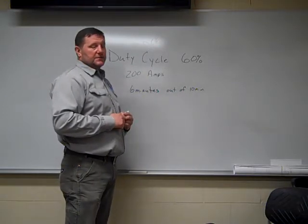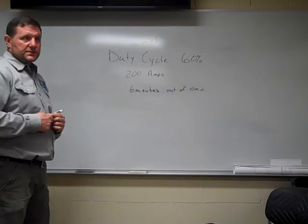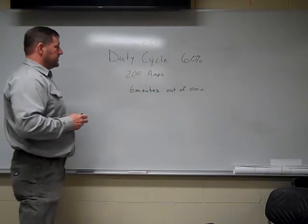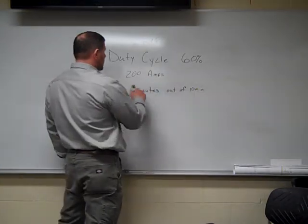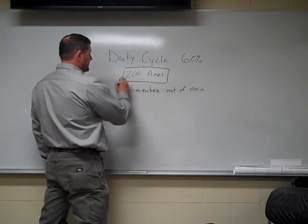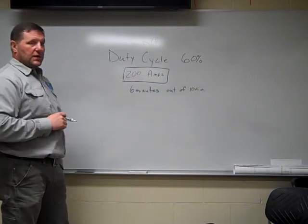Very important when you get into industry, because a lot of times you might be welding for 5 to 6 to 8 hours continuously. Typically a lot of your machines are 60% duty cycle. What's that mean? That means for 6 minutes out of 10, I can run at 200 amps, which is my max output, and then I've got to let it cool down for 4 minutes.